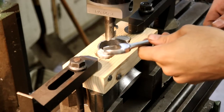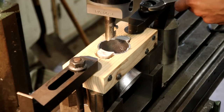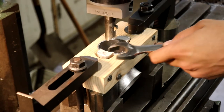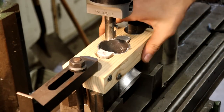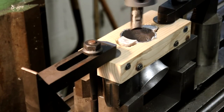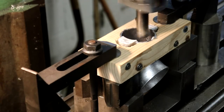For the finished machining, I made a custom fixture — two planks of wood each with a semi-circle cut into it, and a few screws that clamp the wood down tightly around the base of the carb scoop. I had that set up in my mill and, using the boring head, I could indicate to the center of the carb scoop and then very gently take some passes on the inside to clean up the internal diameter so that it can fit onto the tops of the carburetors.